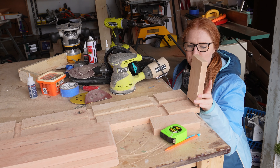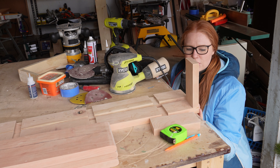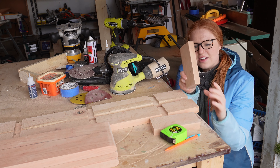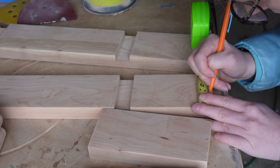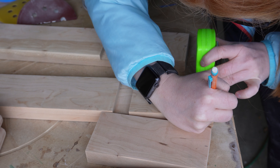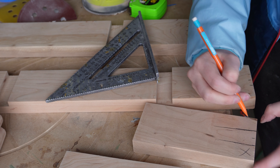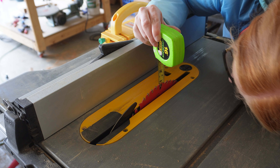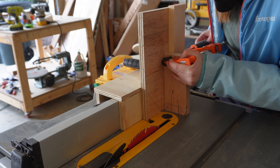Now it is time to make the joints that will allow these to fit together — we're not just attaching them flat. Per the picture there is a certain joint where you notch out the ends and the center of one of the pieces and they all slide together. This is kind of going to be like a simple box joint. I started by measuring the areas I was going to be cutting, marking the pieces to remove with an X so there was no confusion. I built a simple jig for this project to cut these pieces of wood vertically — I just searched on YouTube for a tenon jig or box joint jig and found a simple one. I then attached my wood to the jig and made my repeated cuts just like before.